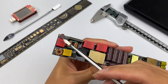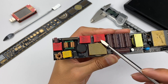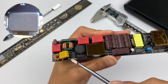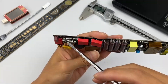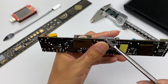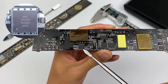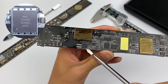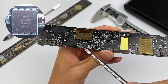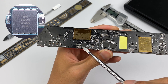The input side is equipped with a fuse of 2A 250V, two common-mode chokes, three red film capacitors, and a yellow safety X capacitor. There are also two SMD Y capacitors from TDX, and four rectifier bridges on the small board. This is the PFC boost inductor, and this PFC controller from ON Semiconductor controls the InnoScience GaN components to drive the inductor. This GaN switching transistor has a 650V withstand voltage and 130mΩ on-resistance, which reduces switching loss and conduction loss in the PFC circuit.